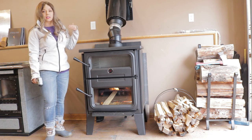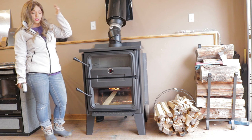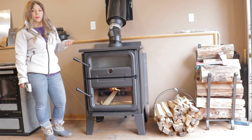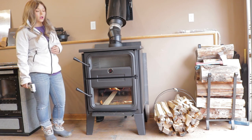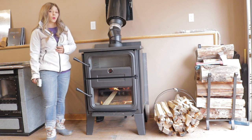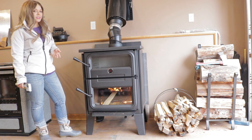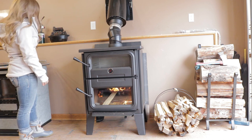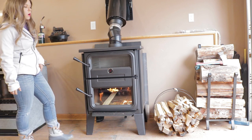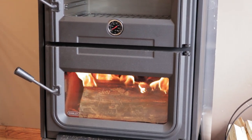As the stove is curing and as the paint is curing, the stove can produce a smell. When I do it, I burn with the door open so that I can get good airflow. You never want to be cooking or baking during your first burn because those smells can go into your food. So keep that in mind — I always burn the stove at least one time before I do any type of cooking or baking. Now that we've been burning at this stage, this medium burn with one log, I'm going to slide one more small log in there to keep it going before I load into my full maximum burn. The stove definitely burns nice and clean, very minimal smoke.